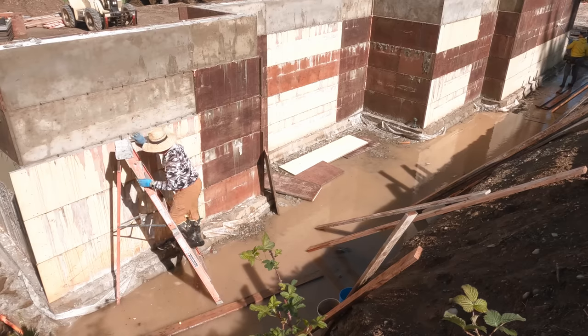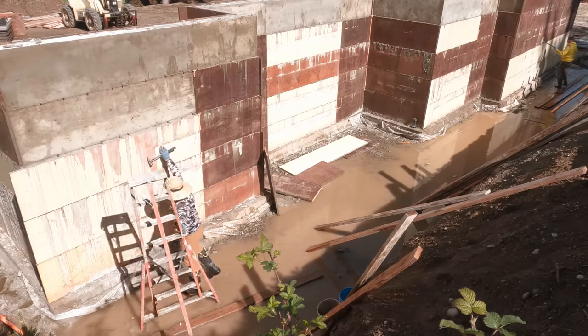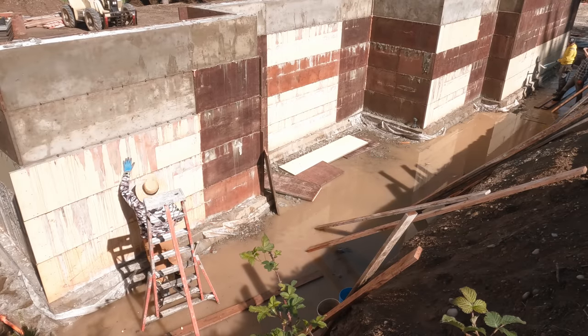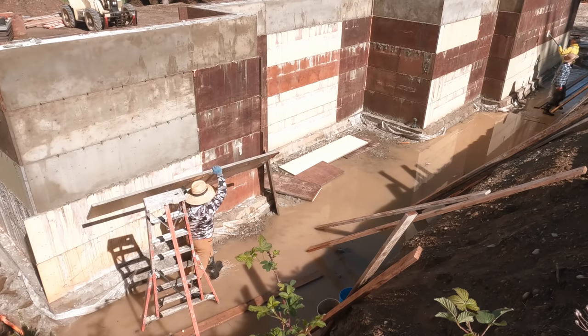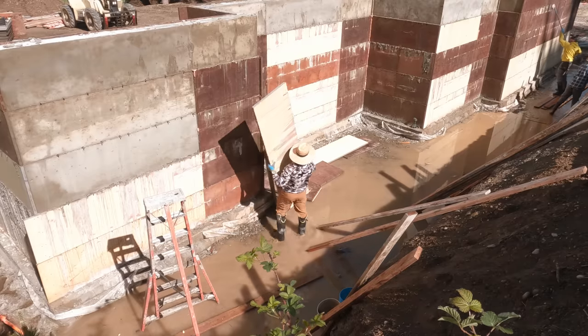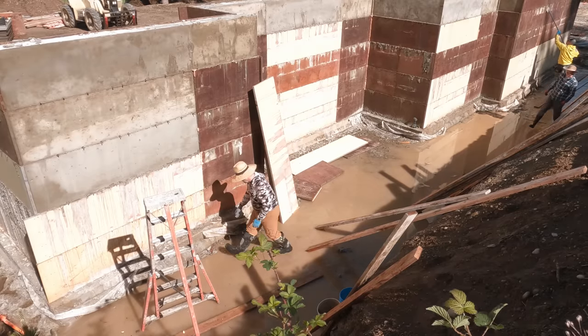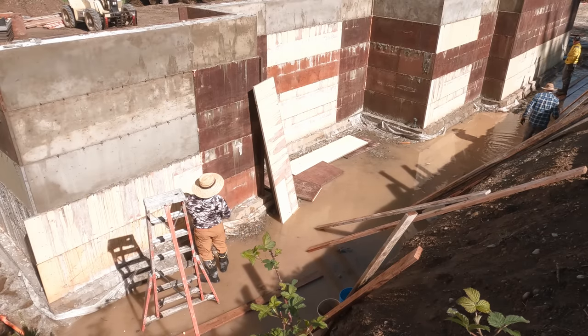What we decided to do is be very systematic and work straight down each section of wall. In this case, those are 8-footers that are coming down. Then it will be a bunch of 4-footers. The guys would scrape the panels, and you'll see that here in just a minute, then place them next door exactly in the spot that we would need them for the next job. And they would oil the panels with that JP Strip, I think is what it's called, made by Dayton.